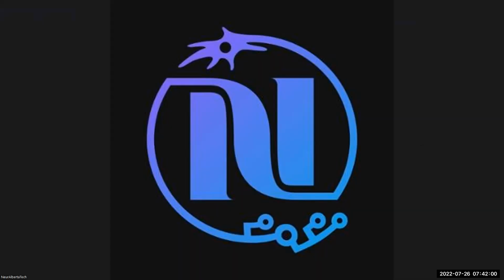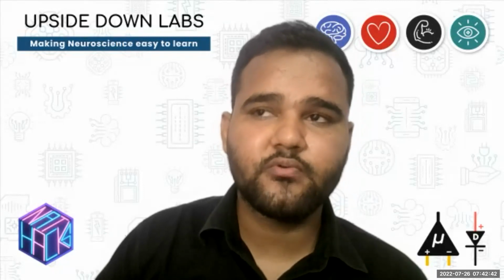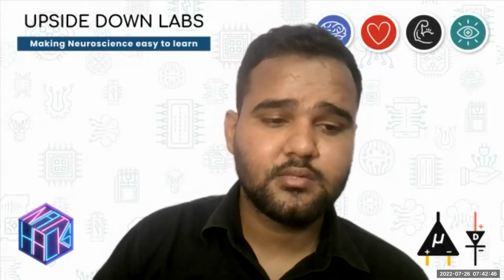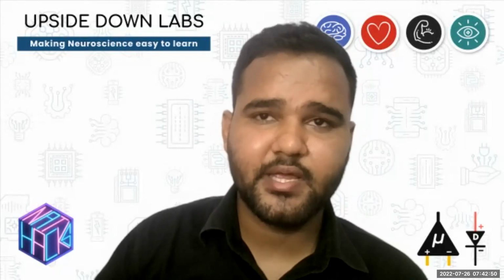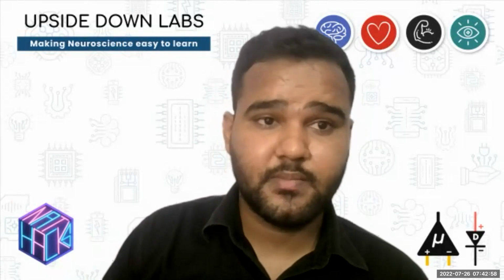Yes, Deepak. Your boards are quite small, and it appears that making sure they're small is quite important to you and your company. I was wondering, when you were designing the boards, did you end up having to cut off certain functionality that you wanted to add, but it would have made the board larger or more complex than you wanted it to be? Yeah, one functionality which we removed is kind of debatable. We removed the input protection diodes. Those are not necessarily needed for our specific application, for how we are treating the device. Other than that, not much is removed.